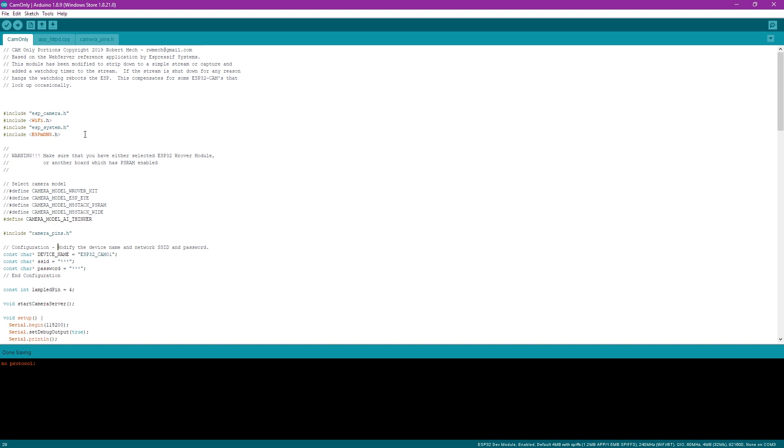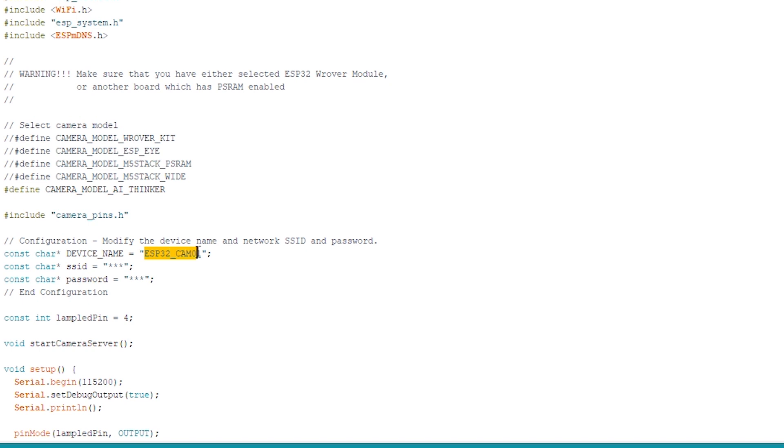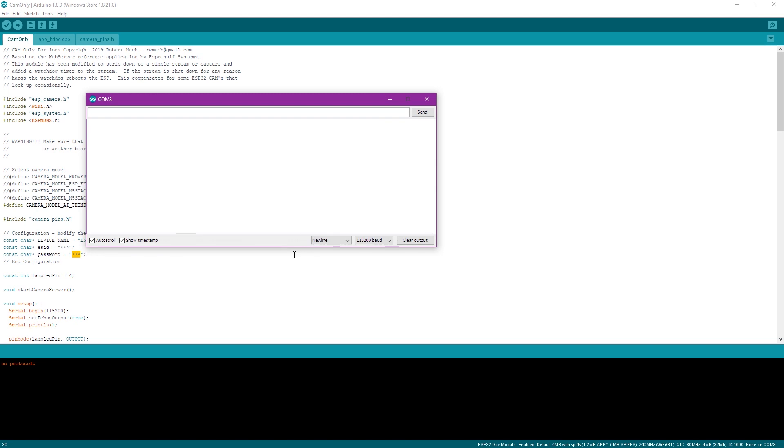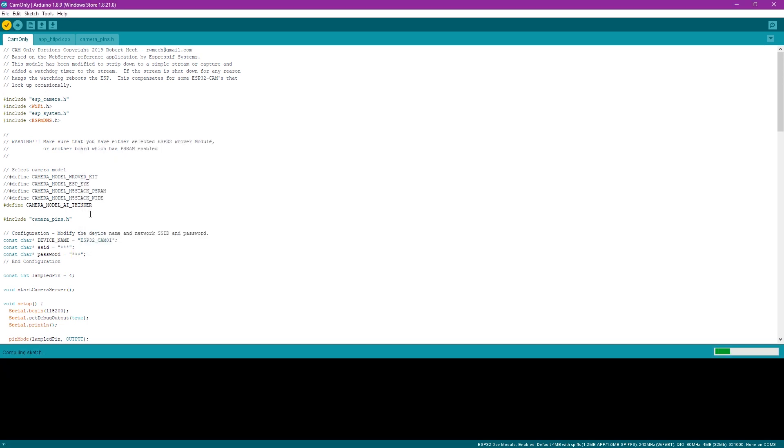Now that we have the hardware assembled, the next step is to burn the firmware onto the ESP32. Load up the Arduino IDE — you can download the firmware directly from my website, with links in the description. What you have to do is simply change a few values: the device name (set it to whatever camera number or name you want on your network), and your SSID and password for your local wireless network. Once complete, compile and send the firmware over to the ESP32. With the serial monitor up, if you hit reset you should see it is waiting for download. Click compile, and once done, click upload to get your firmware all set up.